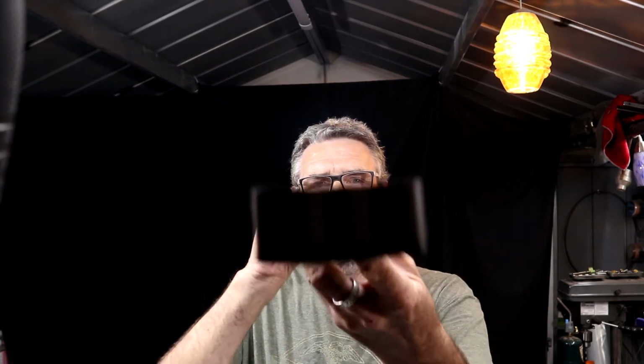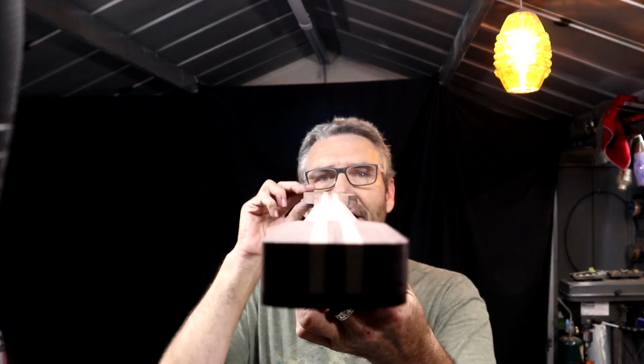And on this neck, I decided while I was shaping it, and I'm not sure how much you can tell by this, you can see it, this is kind of an asymmetrical neck profile. I left it a little bit fatter on this side, and I started to flatten it out down on the treble side. And I've got a pretty round profile right here in the first, up till about the 7th fret. Then I start to flatten out. So not only do I have an asymmetrical profile, I've got a tapered profile as well, which I like.